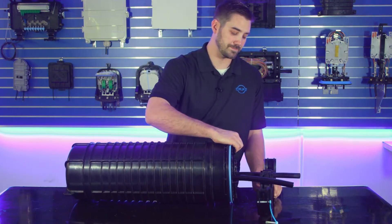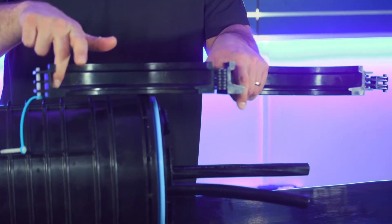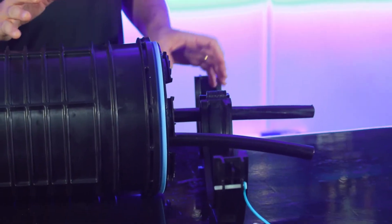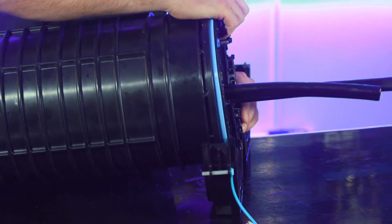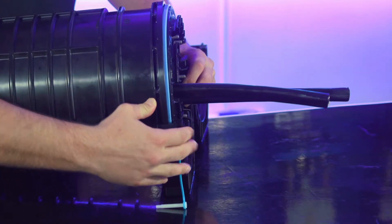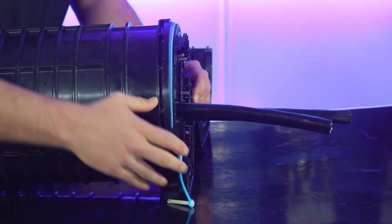The first step here is that the nine-and-a-half inch dome collar still has the same channel as before, just a bit more robust. You'll make sure that the gasket is installed properly with silicone lubricant, then take the dome and fit it right along into the channel. With a downward force, you're going to take the first half of this and force it down into that channel.